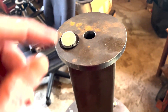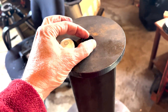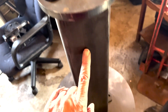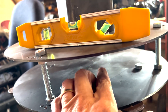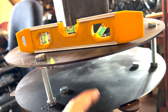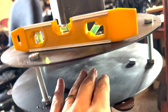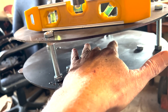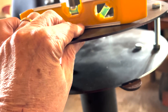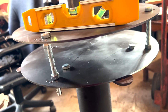The final thing we have to do is get a length of threaded rod, and I'm going to run that down through this — it will screw into the base of the telescope to attach it to the plate, then go all the way down through this tubing and come out underneath. There'll be a wingnut underneath to lock the telescope onto the pier, and it will continue down through a hole I'll drill in the center of the base. I'll put a second wingnut there and finger-tighten it so it's in contact, giving a pillar right in the center of the two plates to pivot on and support some of the telescope's weight to prevent any flexing and transmit that weight down towards the base of the mount.